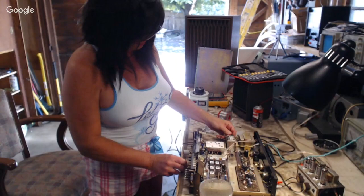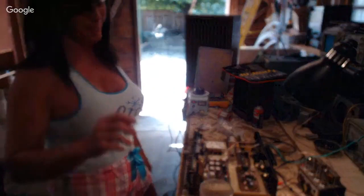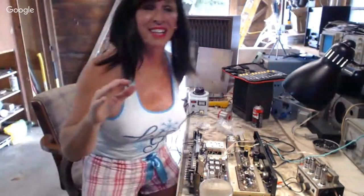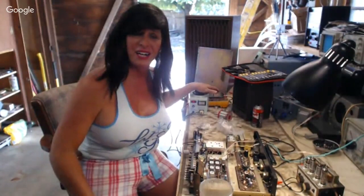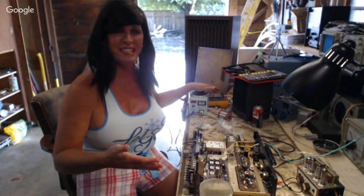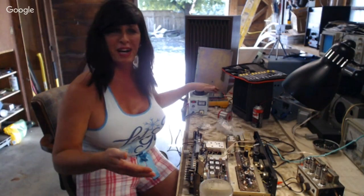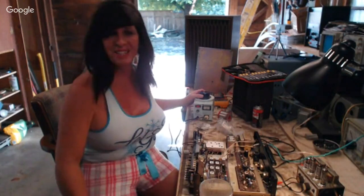Oh my God. You guys are going to crack up when you hear this. You know what happened? I took the voltage up to 65 volts when I was going into protection mode, and I never took the voltage any higher than that. We've been running this thing on 65 volts, and I'm driving myself nuts, wondering why I'm not getting enough output out of this unit. It's because on the Variac I've only got the voltage halfway to what it should be. I told you guys, sometimes I ain't right in the head after surgery and stuff.